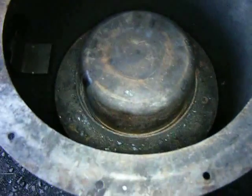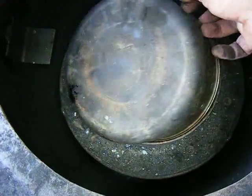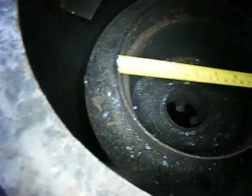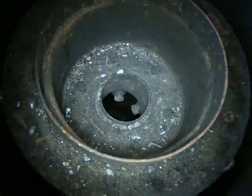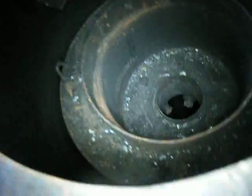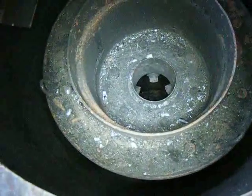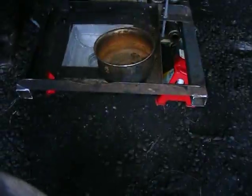What I'm hoping is that will reduce the rate at which charcoal slips out, and at the same time make the charcoal just that little bit deeper. The chamber the charcoal sits in is about 8 inches wide and 6 inches deep. This pan is 4 inches deep, so putting it in there will add 2 or 3 inches, giving something like 7 to 9 inches of charcoal depth — hopefully improving the quality of the gas coming through. This part should then connect up to the charcoal pan to become the new grate for the system.